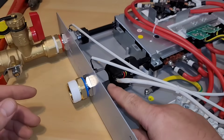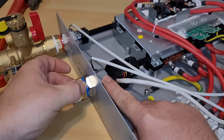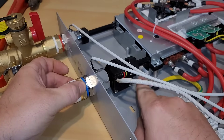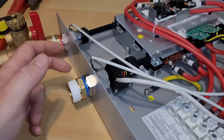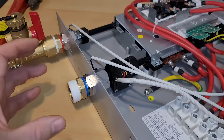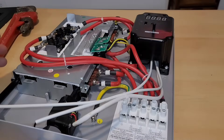With the cover off I can tighten everything with wrenches. I'm going to tie a wrench right here to hold this solid so none of the pieces on the inside are disturbed. I've already done that on the hot water side, and now I'll do the same on the cold water side. Once done, I can put the union back together.